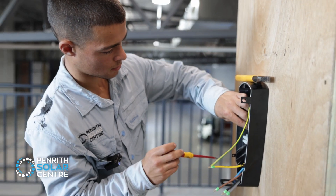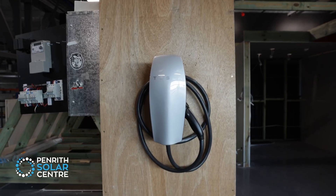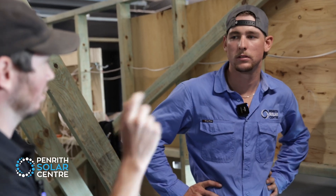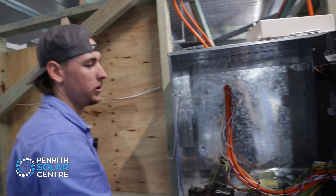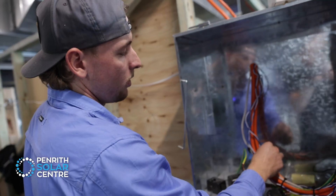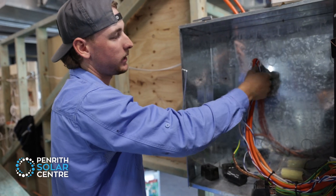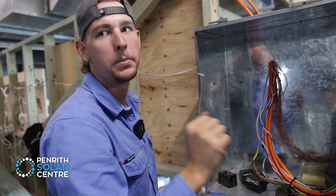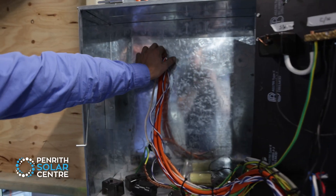We've got a good height — a good charging height — and we'll put this gen-one on again once he's done. There are a couple of different ways to protect the cable: what we normally do is use leftover bits of orange circular insulation, strip that, and use it to protect this cable. The thin metal rubs on it a fair bit when the door opens and shuts, which can cut through insulation and create an IR fault. This is just a bit of mechanical protection for it.